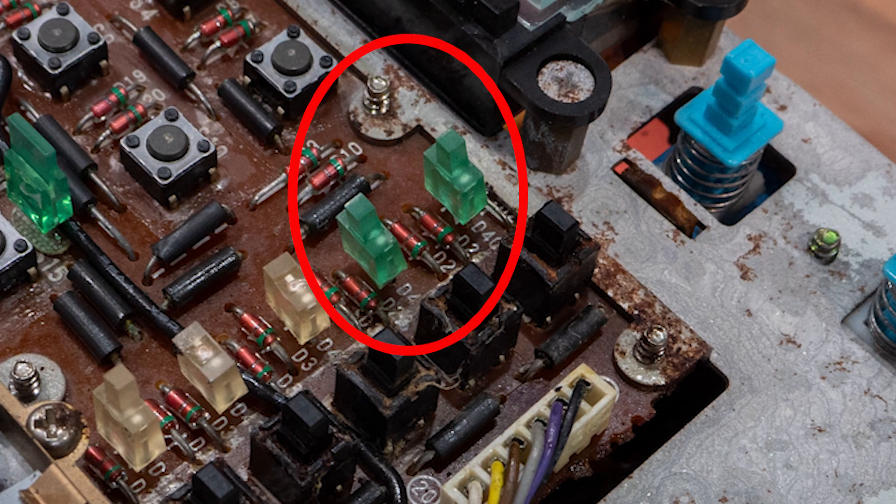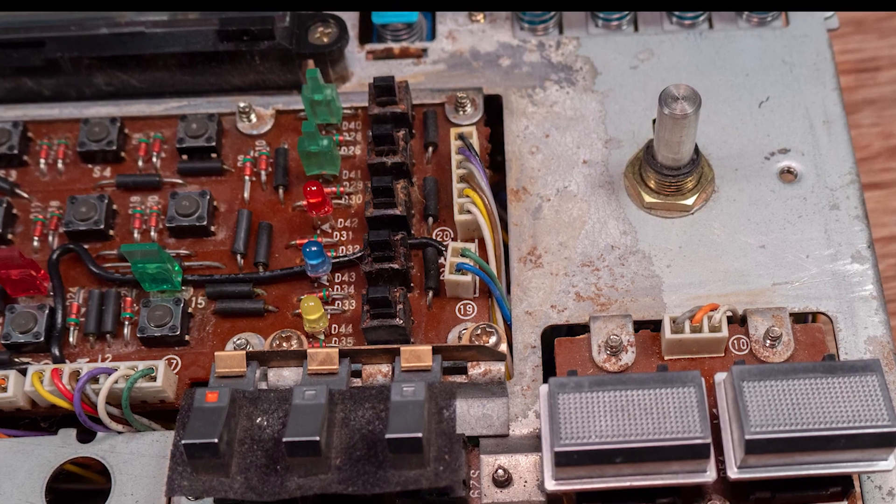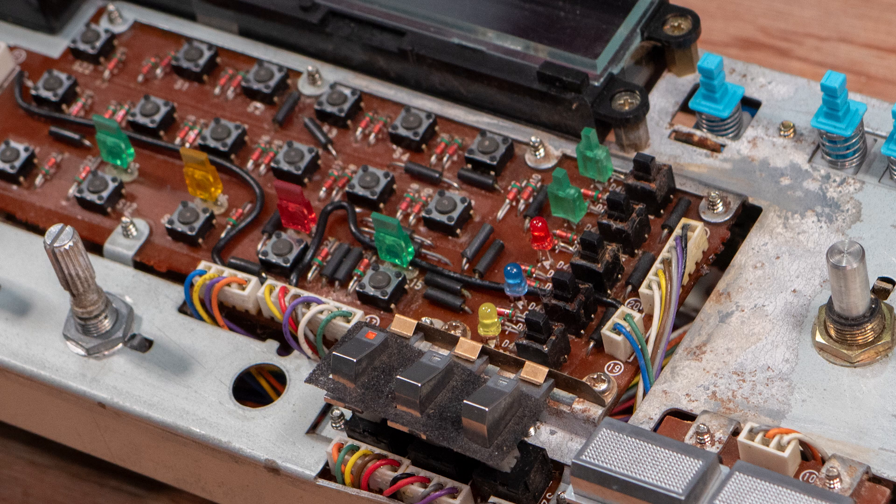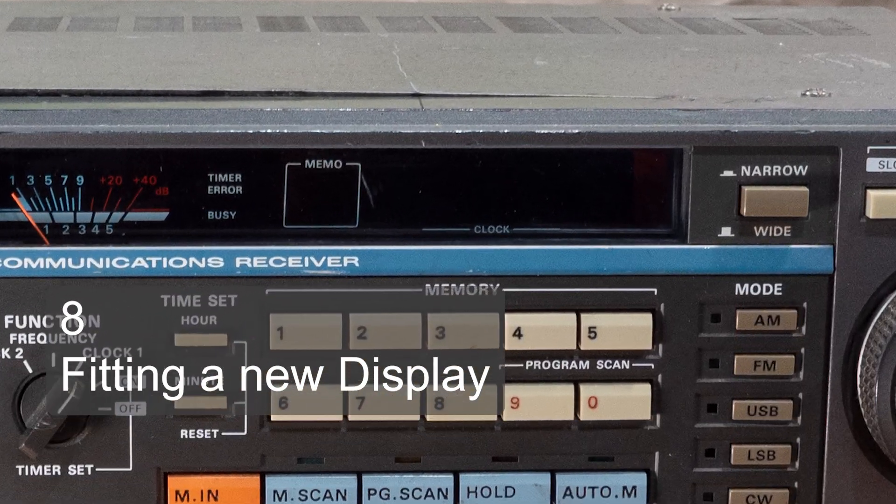After re-soldering some connections I was hopeful all switches would work. I tested the LEDs with probes from a power supply current-limited to 20 milliamps at just a couple of volts. Three appeared defective so I removed and retested them out of circuit. I had to replace them as I didn't have the special LEDs that fit the holes in the cover. I used three millimeter round ones, set slightly lower to give enough space for the cover to fit back on over them.